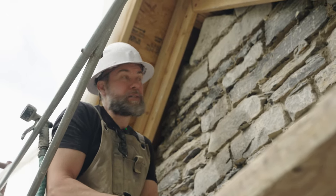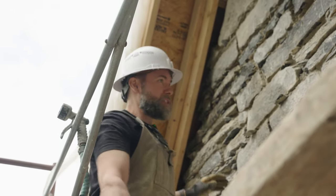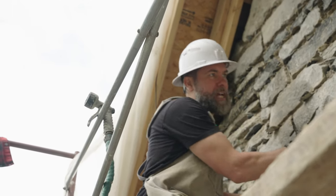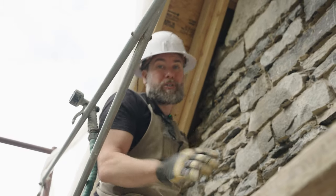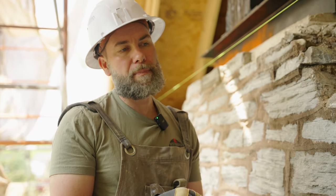This is kind of the in-between process. You can see the peak stone and where the framing ends — the carpenters are going to come in and put a trim board up, because this wall had a lot of undulation to it. The whole wall was out of plumb by about four inches, so we had to bring this section we rebuilt back into plumb and tie it into the back courses. The wall isn't perfectly straight, but that's pretty much par for the course with historic buildings. If you like this video, feel free to subscribe and like our YouTube page. Check out our website at restorationartisans.com — we work primarily here in southeastern Pennsylvania.